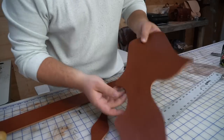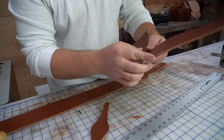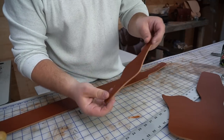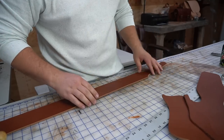All right, before I start beveling this stuff, I'm going to go take this over to the sander and clean up some of these cuts. Some of it's just a little bit rough in some areas, and I can kind of even things out. And when you sand, you actually mushroom out the edges, so that's the perfect time to hit the beveler after you've sanded.